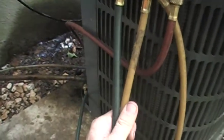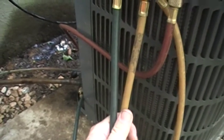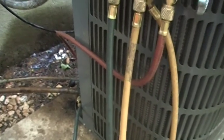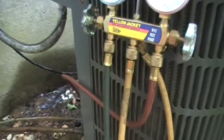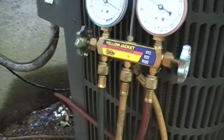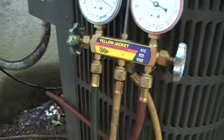I'm going to go through the basic compression cycle and explain it to you. The compressor itself, all it is is a pump — and it pumps vapor refrigerant. It cannot pump a liquid. If you try to make it pump a liquid, it will crash your compressor, and you don't want to replace one — you're looking at about $1,500. The compressor takes low pressure suction gas vapor and compresses it, raising the pressure on it.